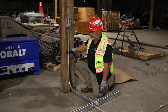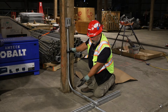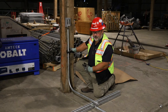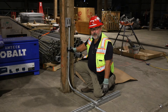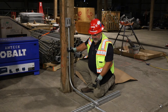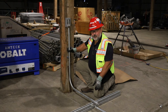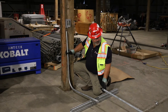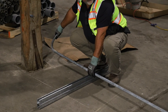The whole idea is to put this into the box and thread it into the conduit. But we've got physics problems. We can't thread it in the box and we can't thread it in the conduit because we've got a floor and a beam. The trick for the box is to take the box off and spin it onto the conduit. For the conduit, there is another fitting called an Erickson or a three-piece coupling, and there are also threadless couplings that look just like an EMT coupling — but most jobs that require rigid despise those fittings. So we have to manipulate it: we've got this conduit that runs more than ten feet that way. That's why I left the strut strap loose — I'm going to spin it, pick it up, wobble it sideways, and get a full revolution on it.